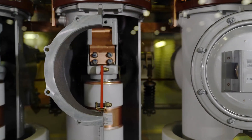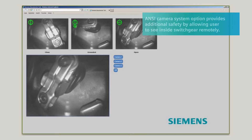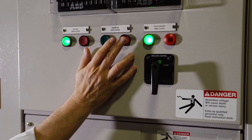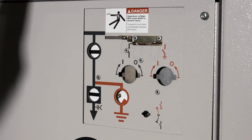Can you elaborate more on the safety features of the GIS? Well, it requires minimal PPE. In the case of air-insulated gear, when the breaker's rolled in, it has the potential — in the case of a failure — to blow out at the operator. With the GIS, everything's self-contained, so an operator can stand in front of this gear with no chance of flashover or blowback. There's no need for racking devices, and most importantly, no need to suit up in all that PPE. Typical requirements are just a fire retardant shirt and a pair of safety glasses. I can take it from online position to a grounded position in less than 30 seconds, so it's a time saver operationally and a big savings on maintenance.